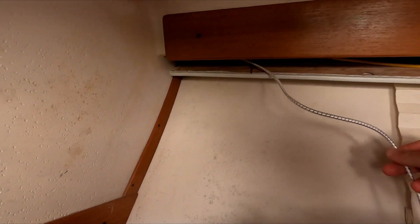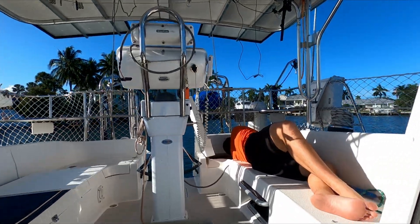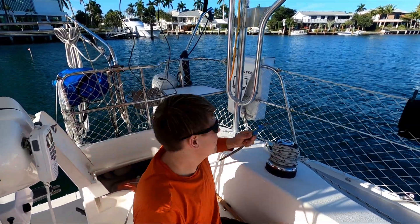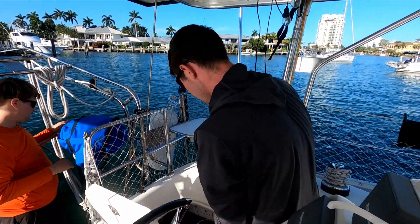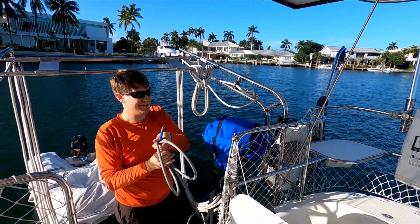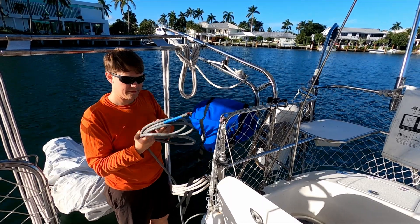Stop — did you try pulling it? How much string you got left over there? About seven feet. We're good. I kind of tied it — can somebody hold this end? It's coming through. Can you hold this end just so it doesn't fall in the bilge? I'll pull it out the back. There it is. We've taken the whole cable out. It's a 40-foot cable, so hopefully it's enough to make two 20-foot cables. It's duplex wire — two 10-gauge wires inside UV weather shielding.